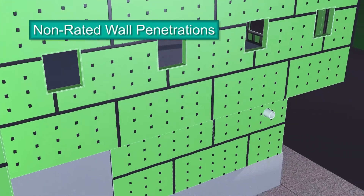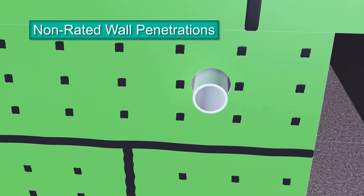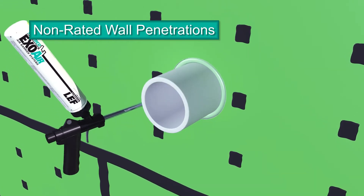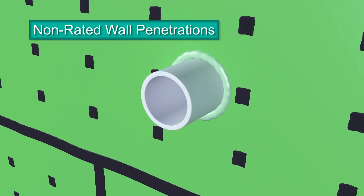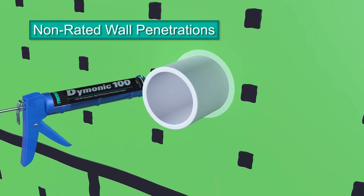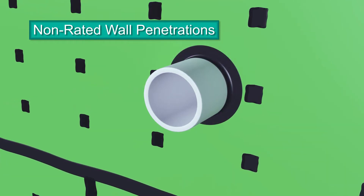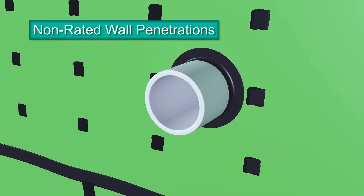Penetrations through walls must be detailed to create a continuous air barrier around a building envelope. These penetrations include plumbing pipes, vents, electrical fixtures, wires, and conduits. Start by filling the gaps around the penetrations with ExoAir LEF low-expanding foam, so it expands slightly beyond the face of the panel. Give the foam about 30 minutes to cure until it's dry to the touch. With a utility knife, trim the foam flush with the panel's face. Next, apply a large bead of Dimonic 100 sealant over the foam, tooling it down onto the face of the panel and onto the penetration, extending a minimum ¼ inch onto both the panel surface and penetration. Ensure there are no holes or gaps in the sealant.